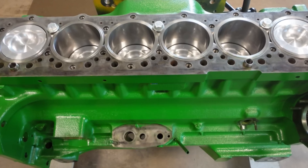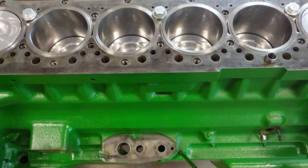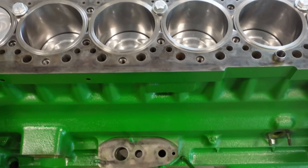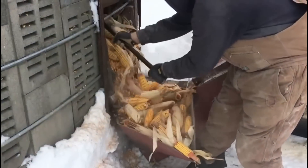One of the biggest things that separated the 4430 and the 4440 was the engine. John Deere decided to go away from the 404 and put a 466 engine in there, and this would prove to be a good choice. The 466 would be a turboed 4 and 5/8 bore by 4 and 3/4 inch stroke that would turn out over 130 horsepower and have a max pull of 13,392 pounds.